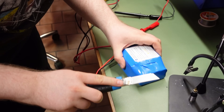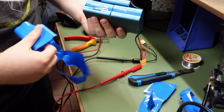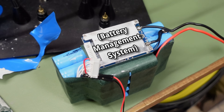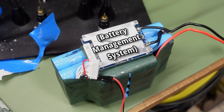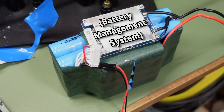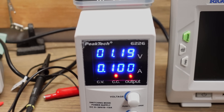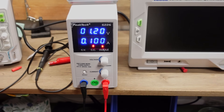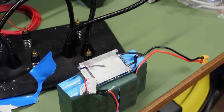One of the broken hoverboards came with a battery, but the battery was dead. We opened it cautiously and found a BMS inside — that's the thing that balances the voltage between the individual cells. Some of the cells were close to zero volts, so we tried to revive them with a power supply at a low current. Sometimes that really works: if the cell can keep a certain voltage, the BMS doesn't refuse to charge it.